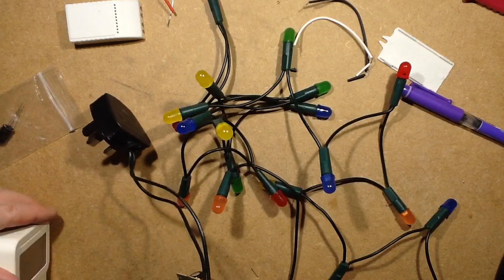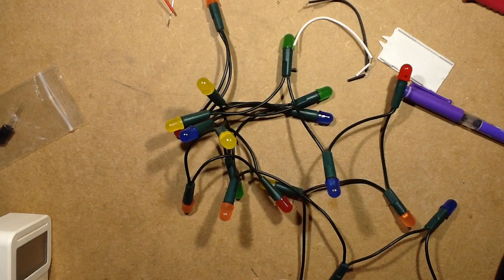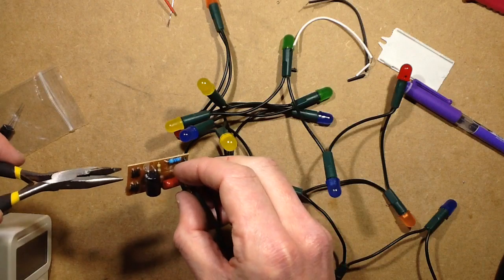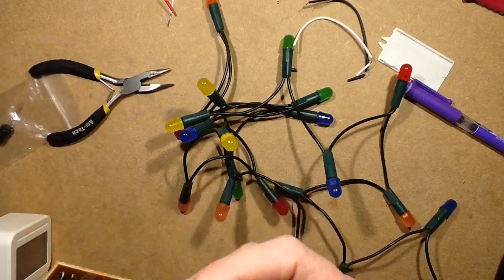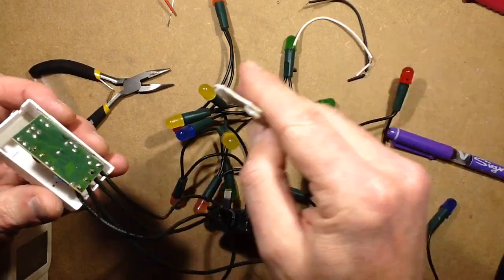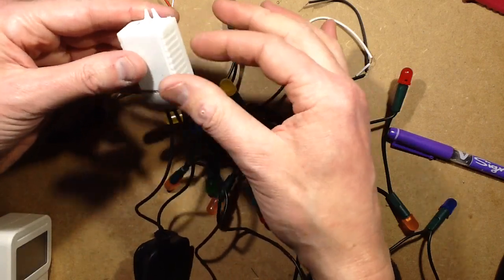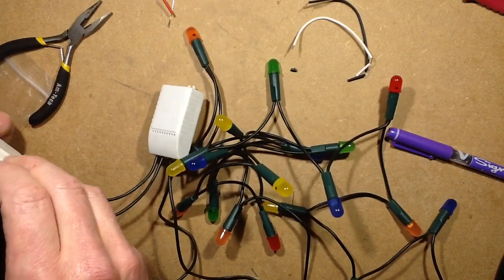Now I know that's working, I'll just pop this into a case before I stick my fingers on it. This is where I have to be precarious, because if that's not fully discharged, the two bits you'd grip it by are where the positive and negative are, so that would be quite nippy. Oh, okay, so I'll just pop that in there, and we'll see what sort of current I'm getting with that 680 nanofarad capacitor. I may end up just changing that for a lower value one, but we'll see. This gets us started anyway. Looks quite neat. These come open so easily, I would recommend putting a cable tie around these to actually lock them shut, just in case people play with them, because kids are attracted to bright lights.